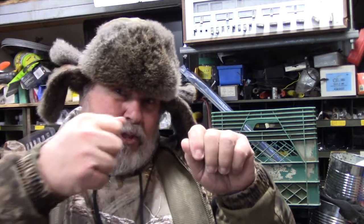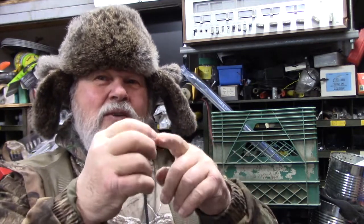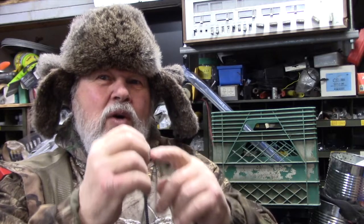Hang on. Electricians come back. Then he puts his plugs and switches on, and his fixtures. So that pulls the wire out, pushes it back in. So every time that wire moves, okay, you're doing that with the wire. So that becomes a weak point in the wire, okay?